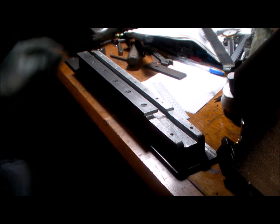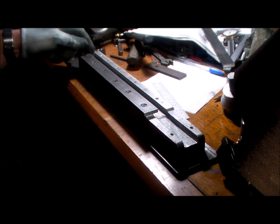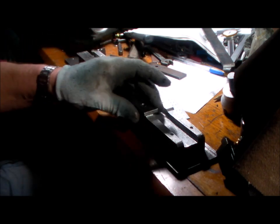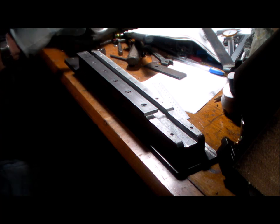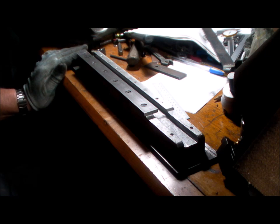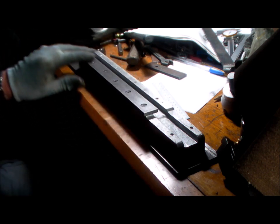Okay, that's the first rail. I'm going to put it in the carriage and with a fly cutter just skim that inner edge — that'll give me a true reference point for the other rail. I've got some 10mm key stock — must be still in the car — that goes in between, the other one comes up against it, and then through this whole process starts again.